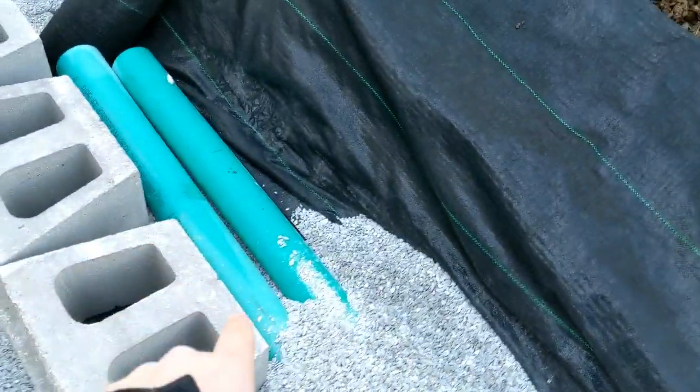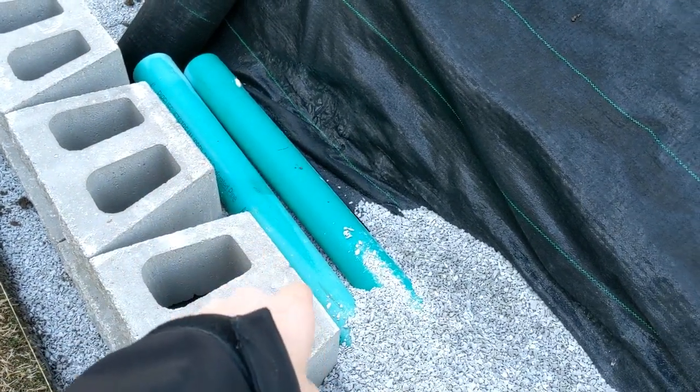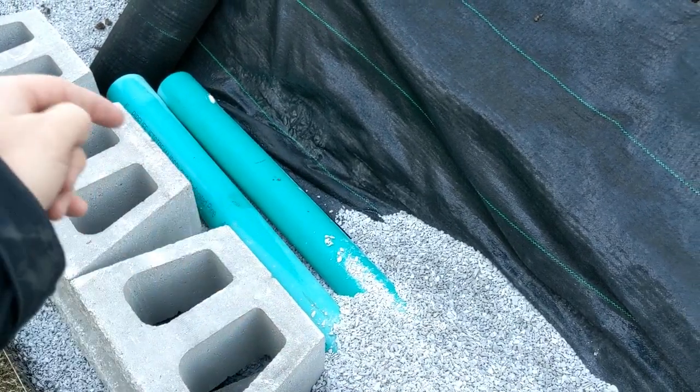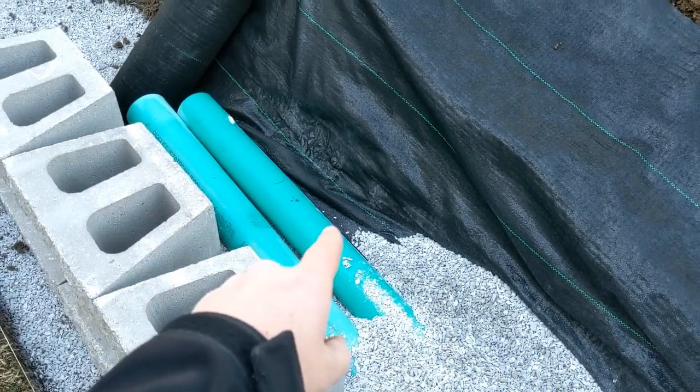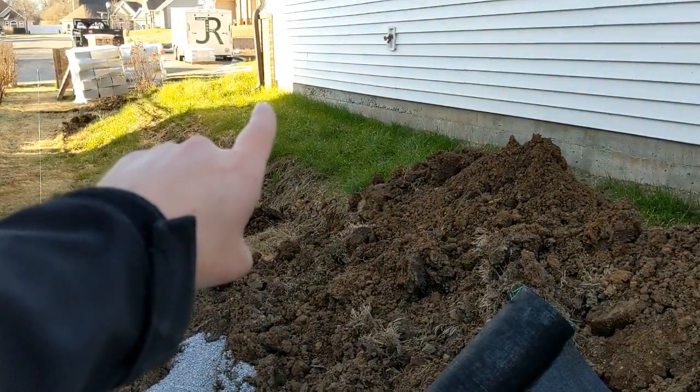So we've got 2 pipes here. One is a pipe for the drainage field on the retaining wall. That's a perforated pipe. That's the one closest inside. Any water that's in the wall will be able to enter that pipe and run out. And the second pipe is a solid pipe, and that's going to be run to route up to our gutter downspout up there.